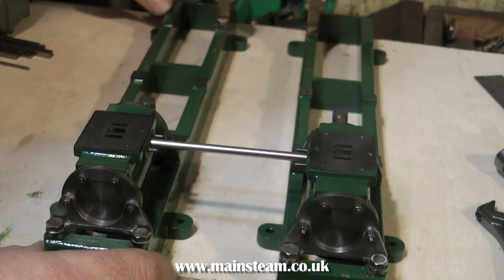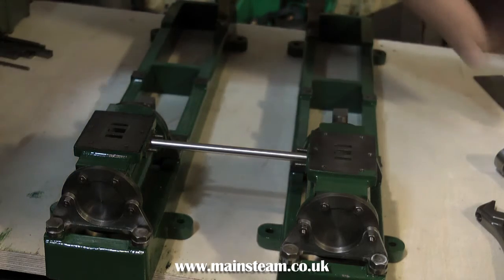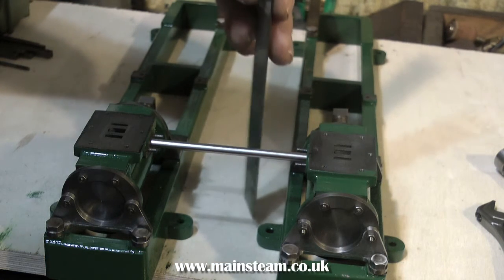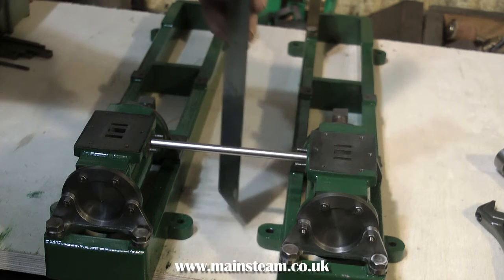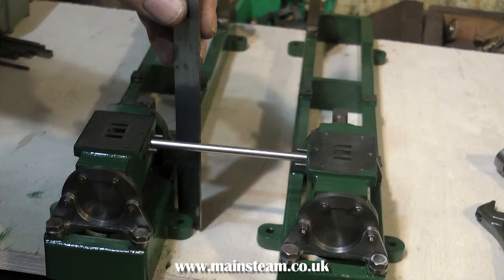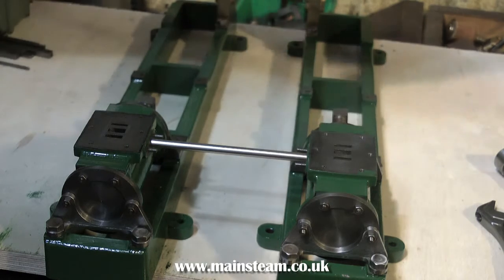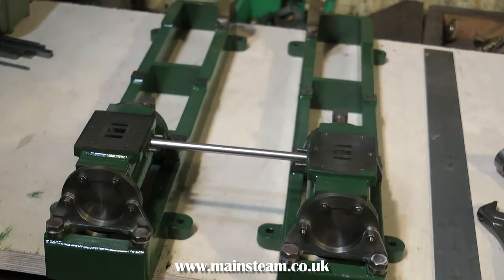Making a single Victoria is one thing, but making a twin is much more difficult — the two cylinders must be in line with each other. This engine wasn't like this at first; both exhausts came to the outside edge of the engine, and I thought that was not a good idea because it's more difficult to have a common collector. So I've reversed the cylinder that I made, so both exhaust ports face each other between the cylinders. But of course, if the cylinders are not in line, getting a pipe to look right is not going to be easy. So here you see me using a piece of 316 steel just to show that yes, the ports are perfectly in line, so that when I make the copper exhaust pipes, everything will look very good.